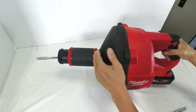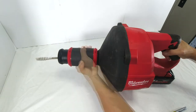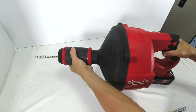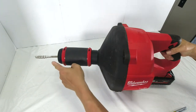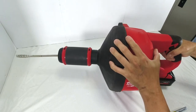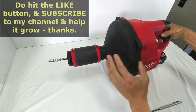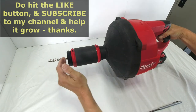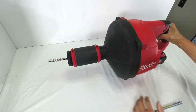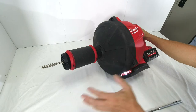The lock position is useful when I've extended the cable to a particular section of the pipe and just want to spin it to clean that section. That's what the lock feature is for. To extend the cable further, I turn this anti-clockwise, push it outwards, and turn it clockwise again. The steel cable extends at a maximum speed of 203 mm per second at a revolution of 600 RPM. When the power trigger is squeezed, there's also a white LED light that shines at the front area.